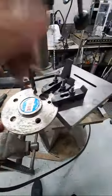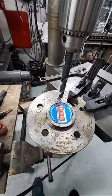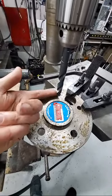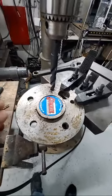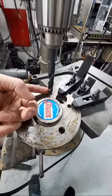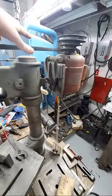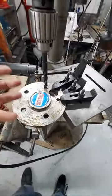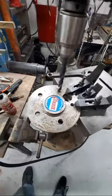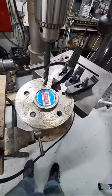So next step is cutting. You want to cut at the right speed. If you cut too slow, it's just going to rub and dull the tip. If you cut too fast, it'll cut too deep and you'll get a big piece of swarf that catches the end of the mill — and you'll likely just spin the belt. Make sure your belt is the right tightness. If you're doing this with a powerful hand drill, it'll turn and yank your arm.